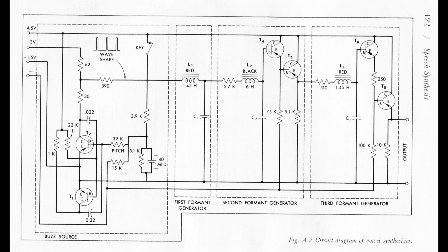The circuit is really simple. It's basically just an exciter — a narrow pulse waveform coming out of a multivibrator made from two transistors, which you can see there at left. And then it's just got a series of three LC resonator tanks — inductor-capacitor combinations that give you specific frequency bandpass filters. They're all coupled to each other, and the last pair is isolated with a simple two-transistor Darlington pair.